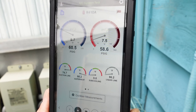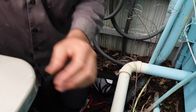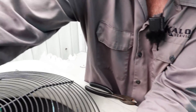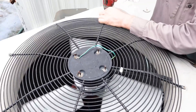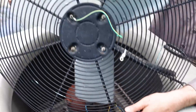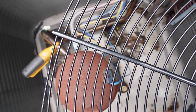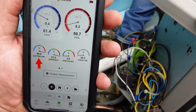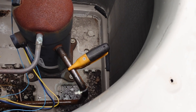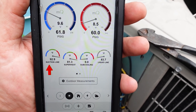So if you look, we're raising slightly, but one thing we're going to check out is our suction line temperature close to the compressor. So we'll move this fan out of the way. And now we're going to watch the suction line temperature — it's already 91 degrees. We've got the suction line clamp there, and the suction line temperature of 91 degrees.